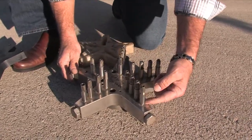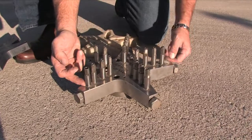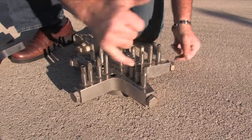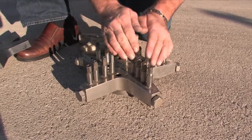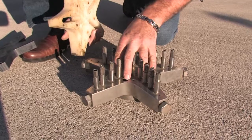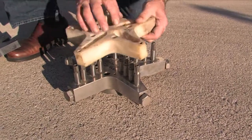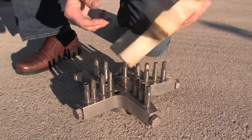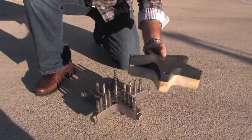And then at the base you have an additional 26 potential leak points, plus an additional 20 for where the nozzle itself attaches to the nozzle extender. If my math is right, that's 47 leak points. When you go to attach the head there are five points of connection — those bolts all have to be torqued into the main shaft — plus five additional bolts that hold the primary to the spray head, and five more bolts holding that on. The nozzles shoot through the plastic, and the plastic protects the nozzles. Last I checked, this component from a competitive source was $135.